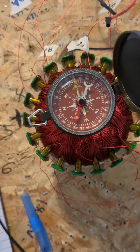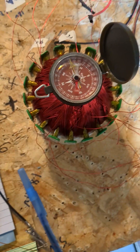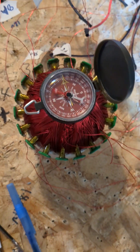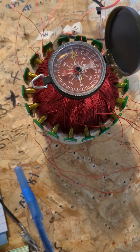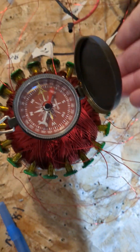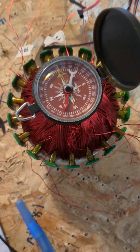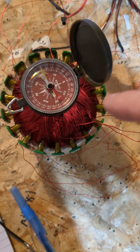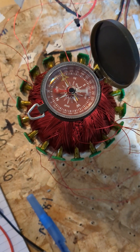Now this creates a virtual rotation as you see, but not exactly smooth because something's wrong with it — just the design. It's very, very difficult to get virtually rotating coils to use two polarity and continuously rotate evenly. We have even rotation on each side, but in between the three poles here and the three poles there it's not exactly even, because that's when the coils start over again. I don't know how to make them go in the other polarity without doing 18 coils instead of nine, so I'm not sure how to correct that yet, but I'm working on it.